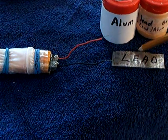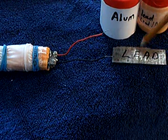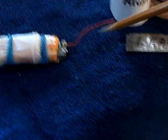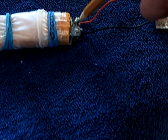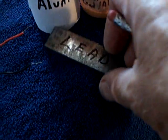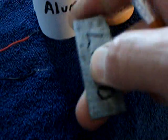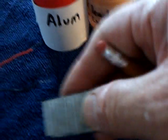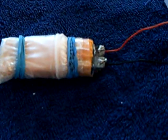I'm continuing to work with these lead and alum and lead oxide cells, rechargeable cells. This one here that I made up was three plates — two negatives on the outside and a positive in the middle — with alum, distilled water, lead oxide, and this linotype lead which has antimony and some tin in it for stiffness so it doesn't bend. They use it for printing linotype and it's thin. It made great plates for batteries. This was the most successful one that I built that holds the most amount of energy.